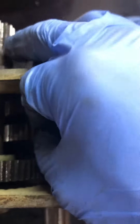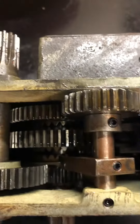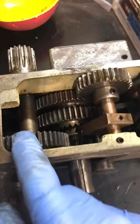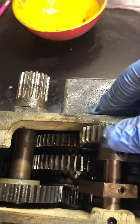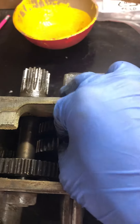That shaft — this middle gear — you can see the teeth on both sides. You pull it out and it engages with this gear, which spins with the carriage wheel. It's loose right now because I had it pulled out, but in the back one, this runs with the — I forgot the name of it — the slide gear, the rack and pinion. So it engages the power feed.